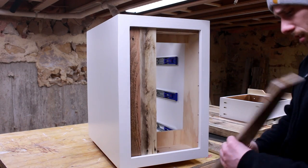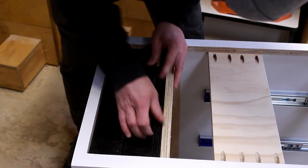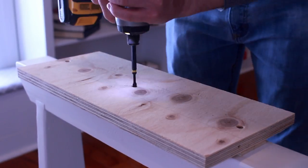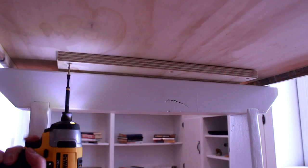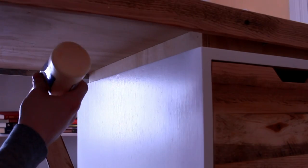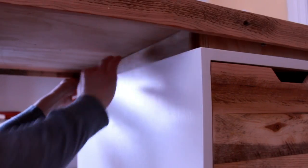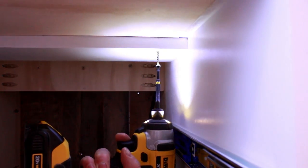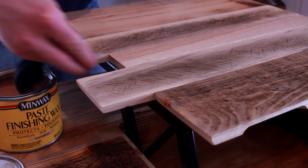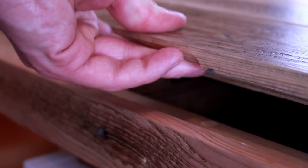For the back of the cabinet I placed more pallet wood that I cut and finished off camera, secured with brad nails. I could then add my power strip. I added a scrap piece of three quarter inch plywood along with a quarter inch strip of plywood and mounted it on top of the sawhorse, which allowed me to secure the sawhorse to the underside of the desk. I covered the outside part of the hidden compartment area with a quarter inch plywood stained the same color as the inside of the drawers, using wood glue and CA glue to hold it in place. Finally I mounted the desktop to the cabinet by securing it from the underside of the support strip inside the cabinet. For last minute adjustments I added paste wax to the edges of the door to smooth the opening and closing, and added a bottom bevel using my router to the front of the door to make it easier to lift up.